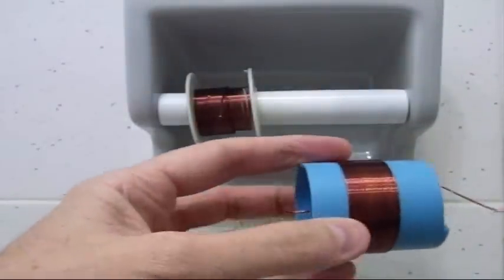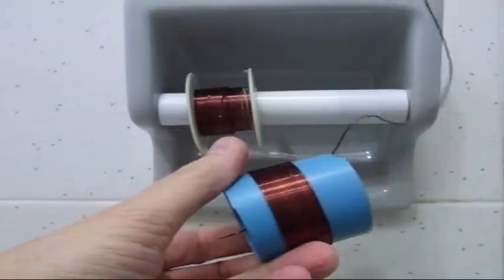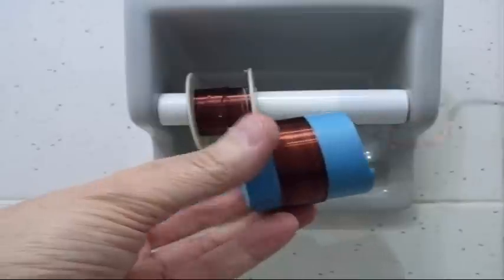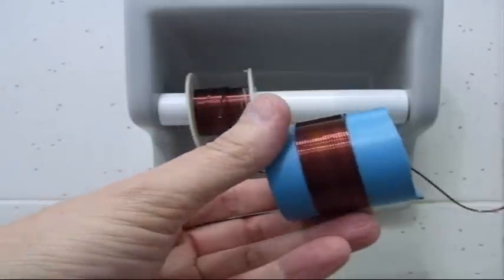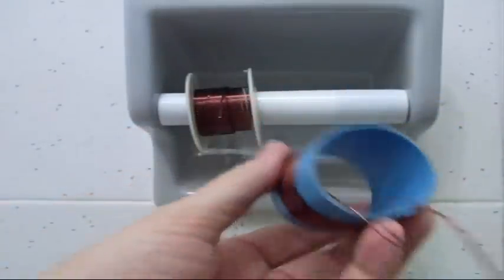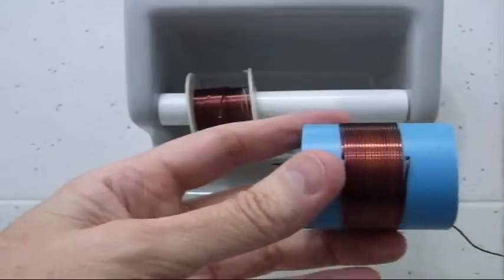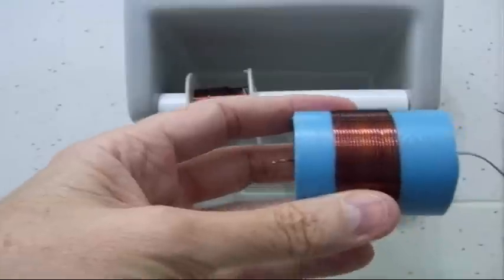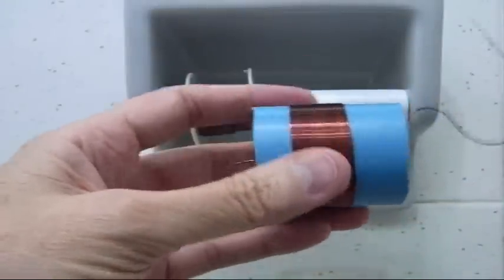Your coil will be six to seven inches long. The coil I made has 170 windings, which is too many — somewhere between 80 and 120 is pretty typical. But anyway, that's how you do it. We'll mount that, as I'll show you with the other coil. This is again the hardest part — so if you can do this, the rest of the radio is super simple.